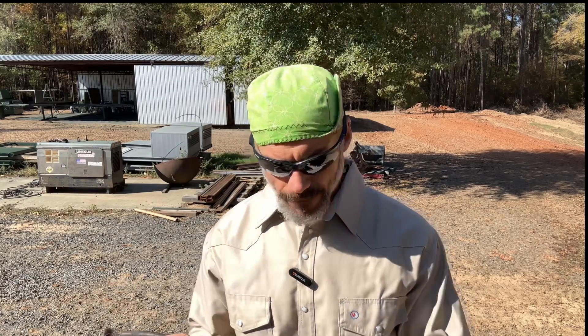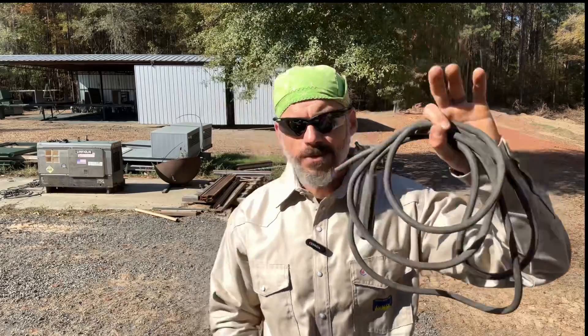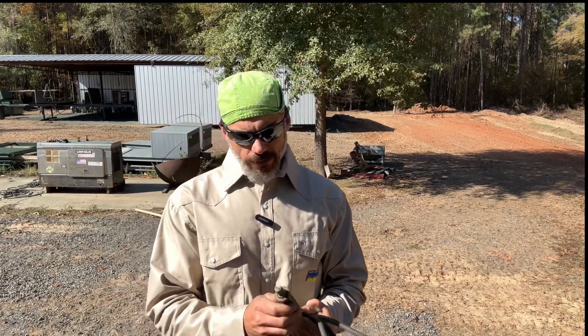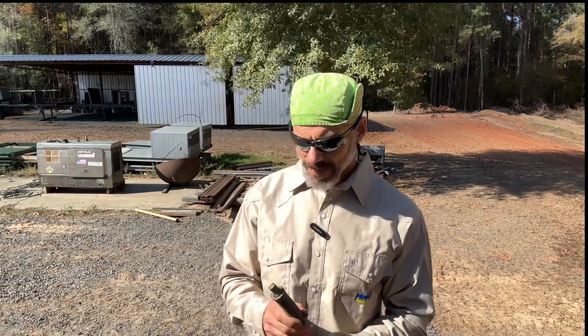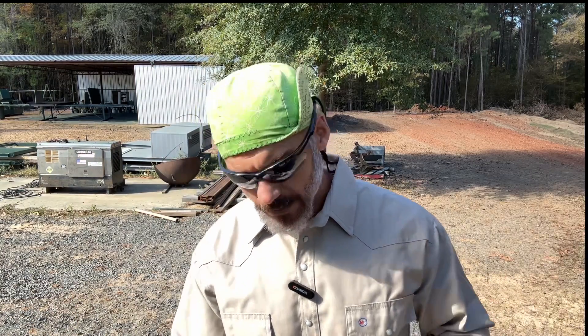Try to find the weak link. This is an old whip I used to use when I was working shutdowns, traveling the road. Keep this in your bucket - you bucket welders. It's not going to be solid using these quick connects, it's just not the best. If you're working in a plant, you've got to. But doing what we do in the field, we don't ever use them - unless you need to join 200 foot of lead together. We very seldom had to do that, if ever, really.